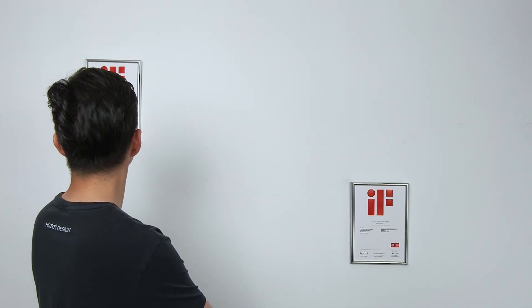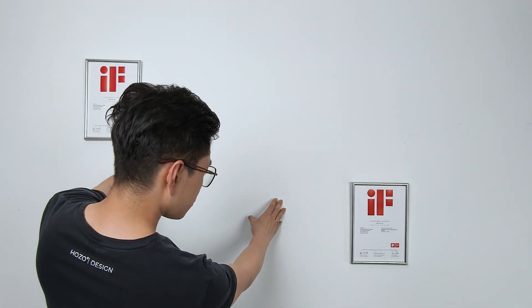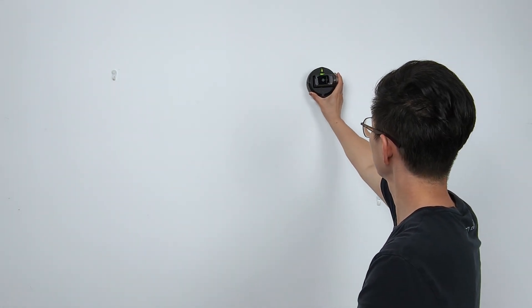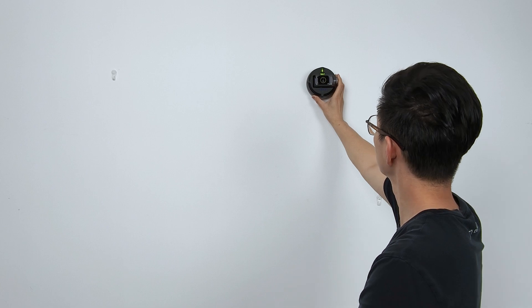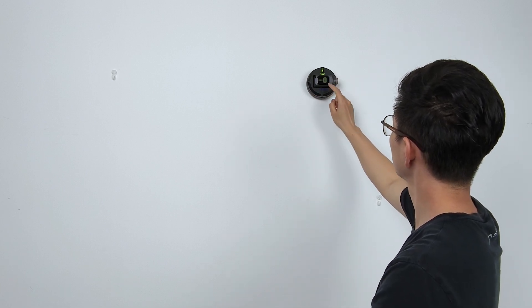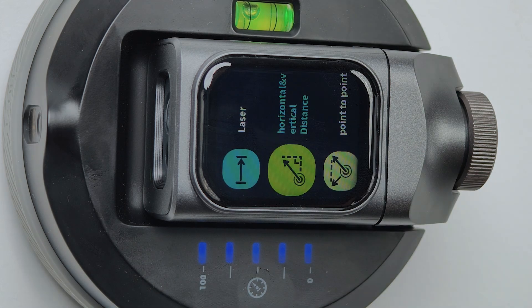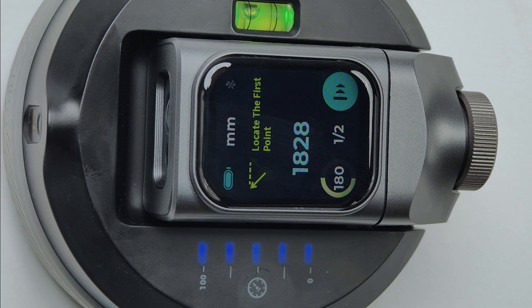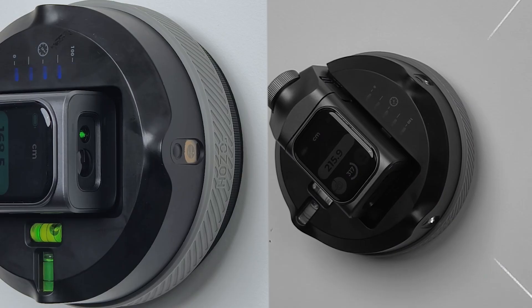Center Finder. Whether the M3O2 is attached to a wall, ceiling, or any other surface, this function helps you find the midpoint between any two points. For instance, if you want to position a third picture frame right in the middle of two existing ones, this function will show you how. Make sure both devices are firmly in place, then pick the center finder function from the main interface. The first two steps are exactly the same as in point-to-point measurement — we use the laser dot of the M3O2 as the reference, and the laser line of the M3O2 won't be used.